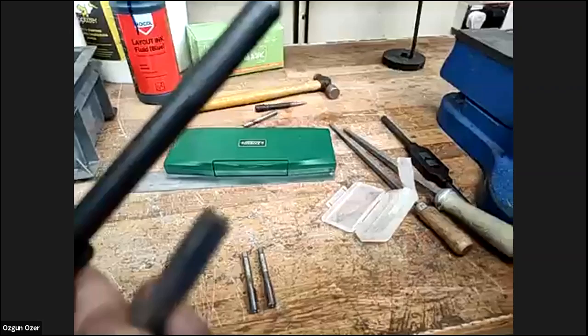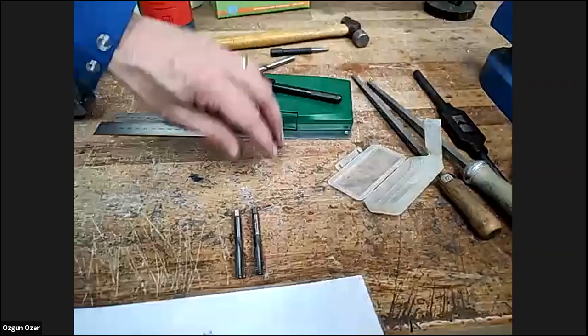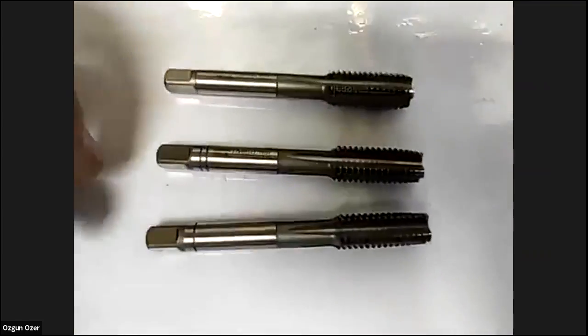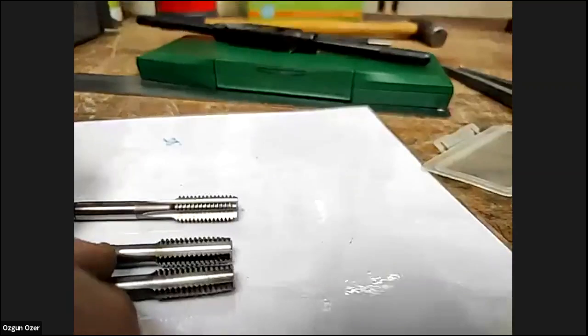So Gary, number 1, it has the highest lead, right? Highest chamfer there? Yeah, you can see. So could you compare two by putting them into the hole? Try and put it on there so maybe you'll see a little bit different. Okay, so the one at the bottom is number 1, is it? Yeah, number 1 at the bottom. So it has the chamfer there. And the one at the top is for the last stage, like finishing. Maybe from the side you see better.